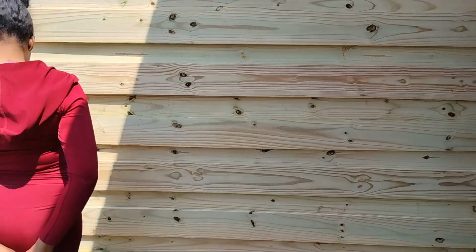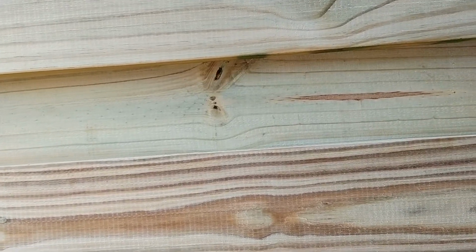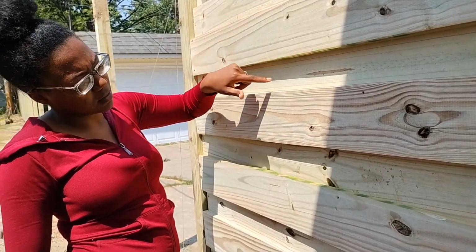Damn, it's 30. We might need 3-inch nails. Even though it's holding, you can feel it. With the 3-inch ones, I can nail one right here in the middle, and it'll go straight through and go into that wood. But if I use the 2-inch, it ain't hitting that wood on the other end because of the space. Okay, so that's what you're saying.